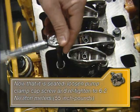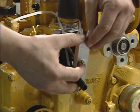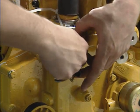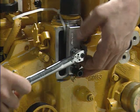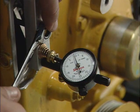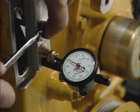Install the retaining pin from special tool JDG10245 into the fuel control rack spring pin. It won't be necessary to push the rack spring back to insert the tool in the spring pin — the tool can be engaged through the rack spring. Now install special tool JDG10245 across the governor opening. The notch in the top of the base will position the gauge bushing, guiding the dial indicator extension onto the fuel control rack plate and allowing the threaded retaining pin to protrude through the hole in the base. Tighten the clamp cap screw to 3.4 newton meters (30 inch pounds). Be sure the base is torqued to 30 inch pounds each time to avoid fluctuations in rack travel measurement. This applies to both the JDG10245 and the JDG2073.